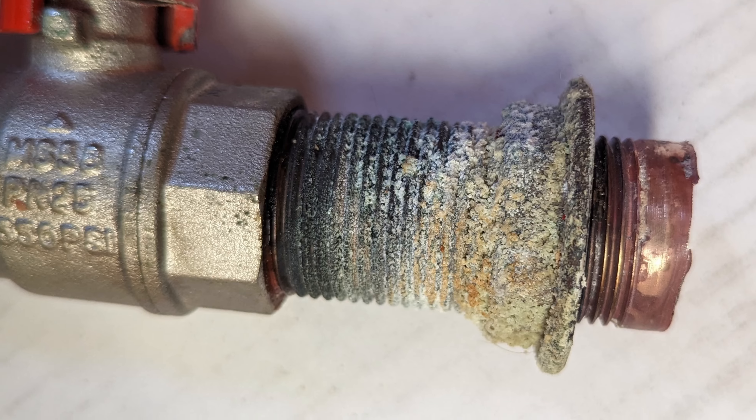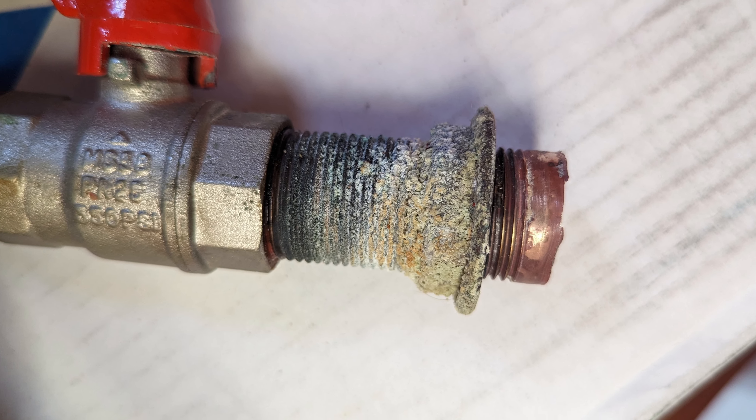Who's changing their through-hulls every five years? I mean it's nuts. I've seen boats where they look fine from the outside, but there is zinc in them — they are a variant of brass — and if the zinc starts to get eaten up they become somewhat porous and quite brittle. I've seen boats that are two years old where you could kick the through-hull and it would snap off. My brother's own boat: in less than two years there were cracks in some of the elbows coming off the through-hulls, which were DZR brass, eaten right through the elbows.